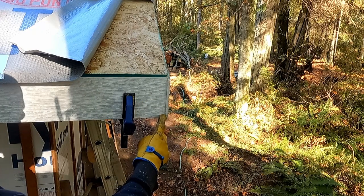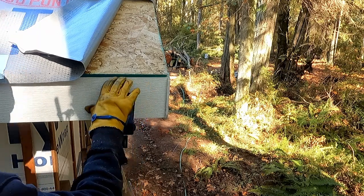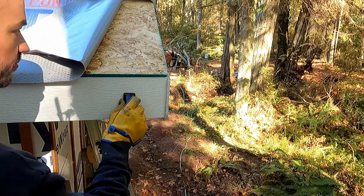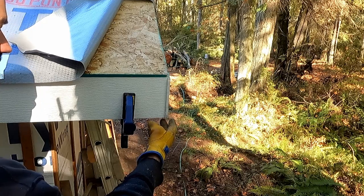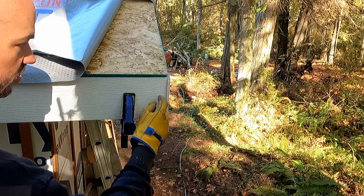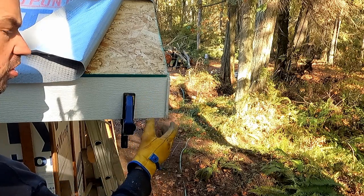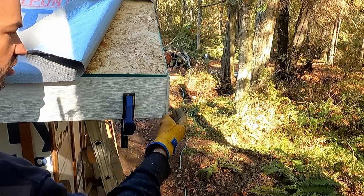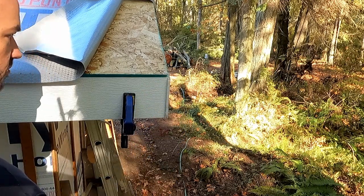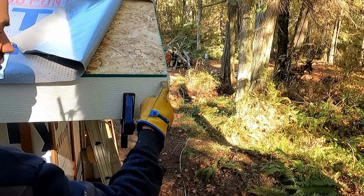Now that I'm happy with this fit, I'm going to separate the joint. I have a clamp off-camera supporting the tail end. I'll loosen it, slide the whole thing over, smear a bunch of cement in here, butt them up, clamp it, and let it dry — that should provide the mechanical bond I'm looking for. Then I have some glass eyedroppers, and I'll come back and fill the face here in case there are any little gaps that didn't fill up when I did the first glue-up. That's more about caulking it — that is the water-resistant surface as opposed to the mechanical connection. Then I'll cut this all off flush, tidy up this broken corner, maybe do another layer of cement, and then screw this in from the back of the sub-fascia. This piece will be installed and this corner will be water-fast.